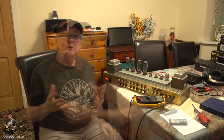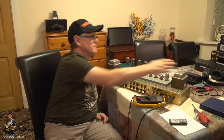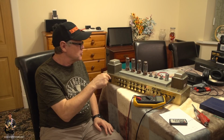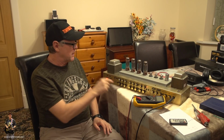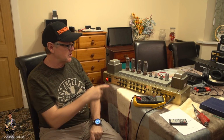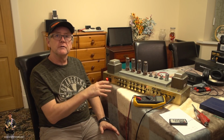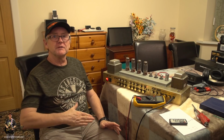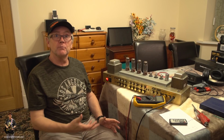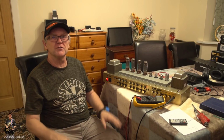It's easier. Now, of course, this has been running for some while now. It's actually quite warm. In fact, it's very warm. And you should go back and check those tubes again to make sure there's no real drift, especially on this amp, the TSL100. It might be a DSL that you're on, but this is a TSL100 JCM2000. And the thing is, on the old board, this is what all the problem's about, the drifting of the bias until the power tubes actually blow, or the board blows, or something goes, and then you never get it back right.